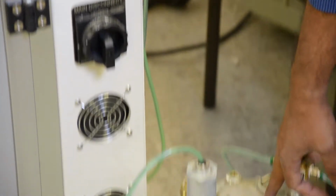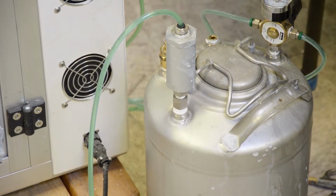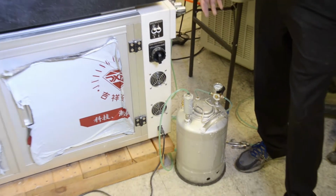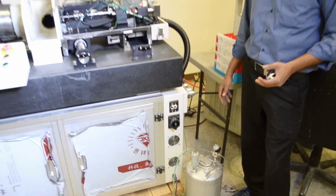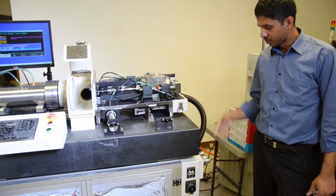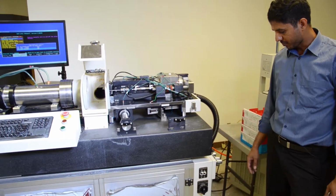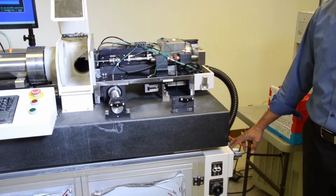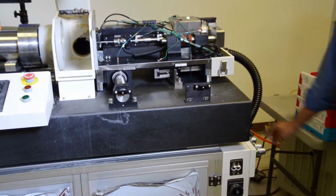We use a mist in this tank, so it's a solution and water composition with 1 to 20. So 1 cup of chemicals, 20 cups of water, we mix it together, and we use this in the cutting process. So it's a mist technology. These are the controls here, one is for the water, one is for the air, for one roughing, one finishing.